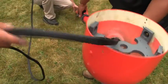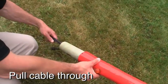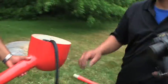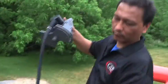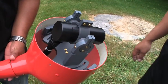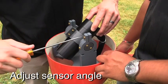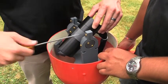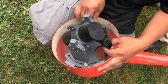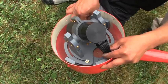Shaking helps to move the cable down the arm. When the cable comes through the other end, grab it and pull it through. Notice that the cable is pulled fairly tight and the gimbal is installed onto the gimbal plate. Now adjust the sensor for the correct angle. This angle is determined by the hemisphere and the angle of the local magnetic field. The next step will help you in arranging the screws into the gimbal plate. Turn the gimbal again and tighten the sensor screw.